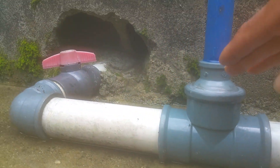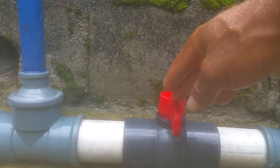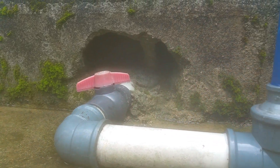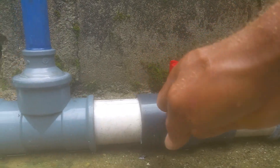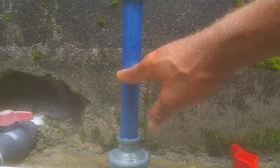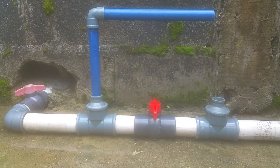This aspect you are seeing here serves as a discharge pipe, which takes water completely from the pond. But with this system, water will not go out completely. Whenever this valve is closed, it will not allow water to flow out through this outlet, locking this entire area. Water will then build up inside this pipe, and when it gets to the level of the horizontal pipe, the water will start flowing out.